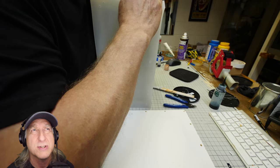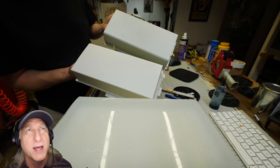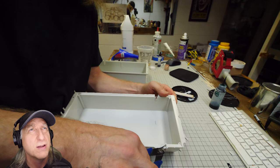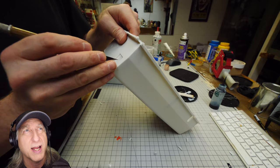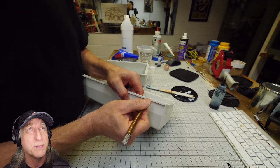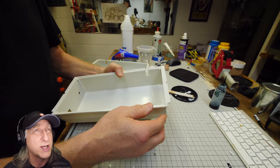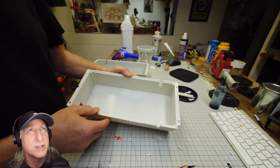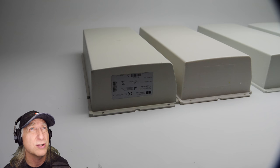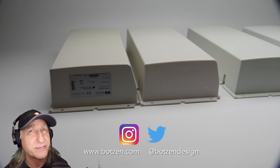I also find that pouring your resin a little bit thicker — almost letting it set up — will also reduce the amount of bubbles. There you can see the cast part and the original: there's very very little flash on the part along that seam line on the top. I take a pair of flush cutters and trim off the vent holes — there's very little post-processing that has to happen. I need to make 10 of these units for my customer, so I want to do as little as possible after I mold them. Here are some of the parts, and you can see that probably the hardest part of this project was just getting the color right — it took a few pours to figure out the color value.